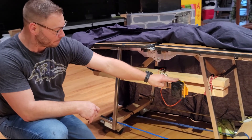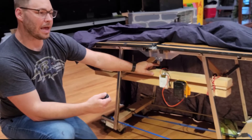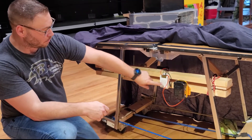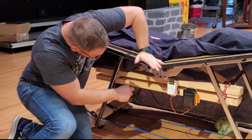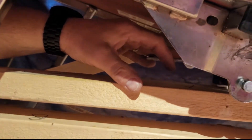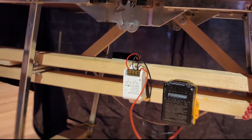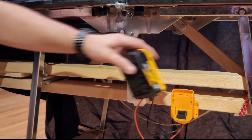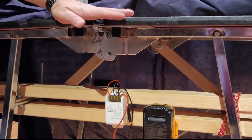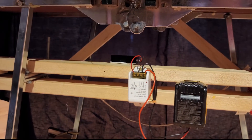To actually power it, we use a DeWalt battery into a wireless on/off switch to a magnet that goes for like a door access. If I turn it on — you see the on button here — this comes down. You can probably see it here. This actually catches right in here, this magnet here. When I release it, it pops up. So that's how it works. Powered by a DeWalt battery. We put an adapter here that holds the battery itself. Turn it on, goes down, catches. When I hit off, it releases and pops up.